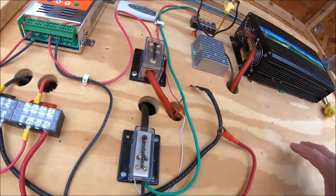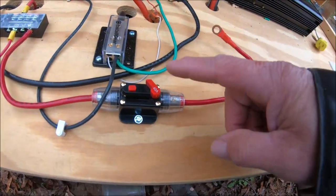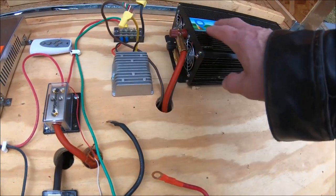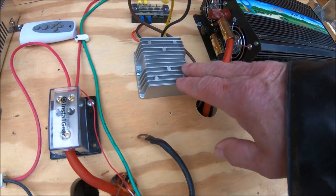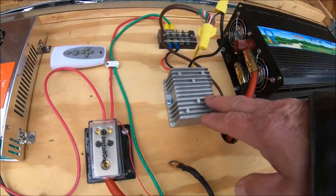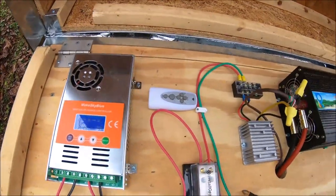I've got larger wires going down to the batteries. The grid tie inverter connection is disconnected and tripped, so that is not live. This is a 12 volt buck converter, and what it does is take the 24 volts off the system — or whatever voltage, it's showing 34.4 — and converts that down to power the inverter.